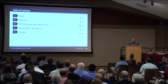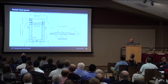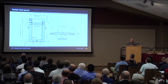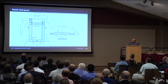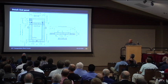This is an end panel. Just like we'd have on our bridges, we have that thickened end region at the beginning and end of a span unit. This panel takes care of that. We have a densification of steel. This hatched area is a region that we can leave out to put the SEJ or our armor joint, if need be. The panels vary width-wise from six feet to eight feet due to transportation issues. The lengths vary based on the girder spacing and the overhang width.